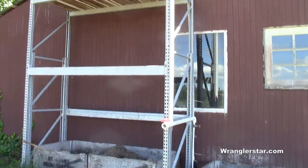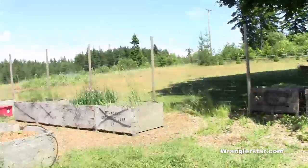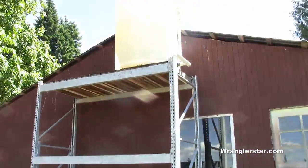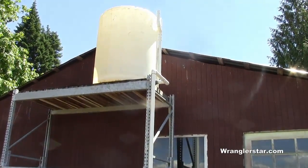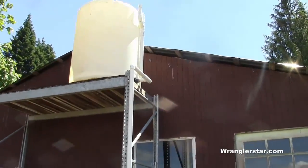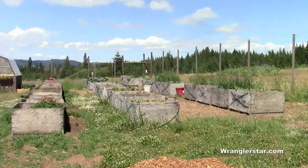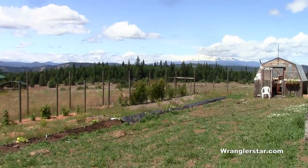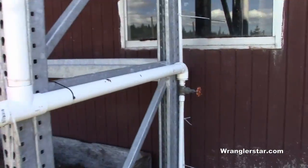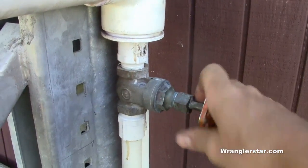Here's my water tower — just made out of some pallet racks — and the ram pump actually fills it up. We're in the midst of the garden here. The reason why we have a water tower and why it's up so high is that it provides pressure: every foot of elevation gives you roughly just under half a PSI per foot. By putting that water tower way up high, it gives me enough pressure to water all of our garden and all of our boxes using the ram pump — no electricity, a completely off-grid system.